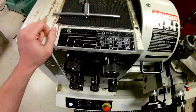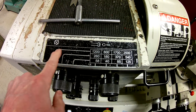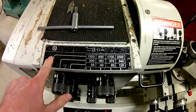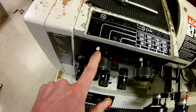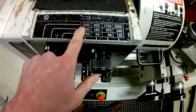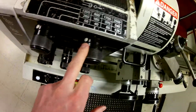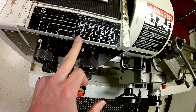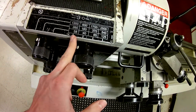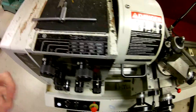Take a look at the chart on top here — it's reasonably intuitive. You'll notice lines corresponding with rows coming over to different positions. Right now my indicator on the dial is lined up with a row that could be 1200, 817, or 25. This selector down here also has an indicator, and the lines correspond with columns. Right now I'm on the left column, top row — that's 1200 RPM.